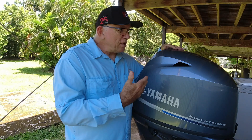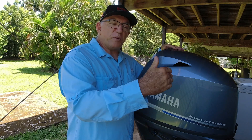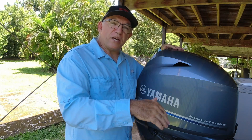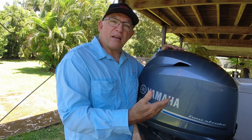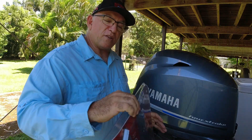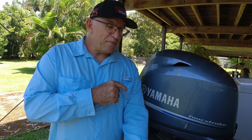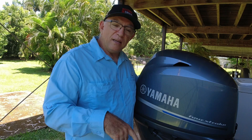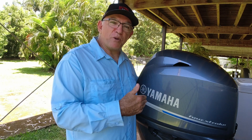I've had this boat for a few months and I've persisted with a small problem — a bit of ventilation and cavitation in tight corners. Since putting an extra battery across the transom I've got more weight at the back, so especially with two blokes in it, it's a bit sluggish coming out of the hole. I'm going to put a SE300 foil on and show you how quick and easy they are to fit. I've done some water testing without the foil, so I'll fit it and see if it makes much of a difference.